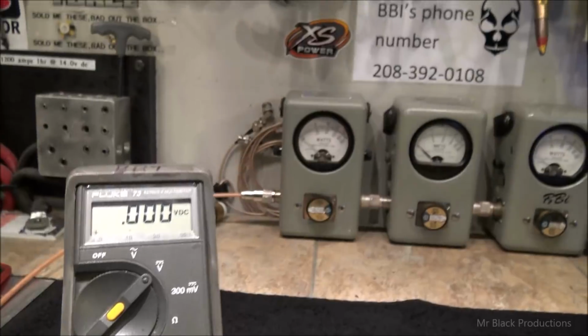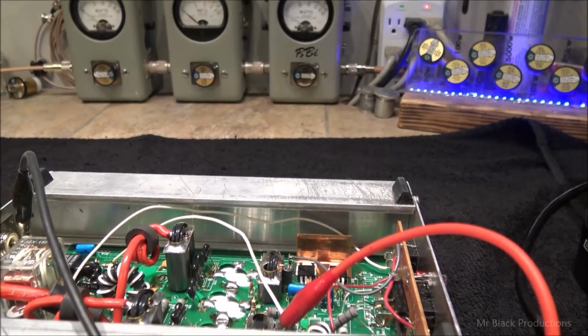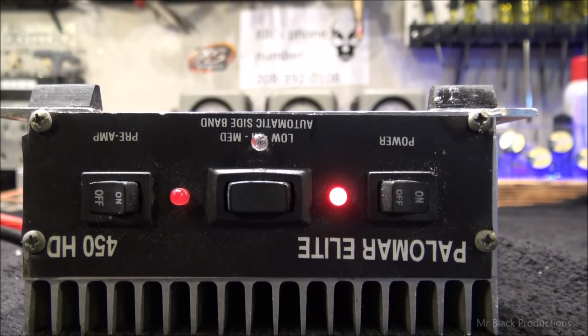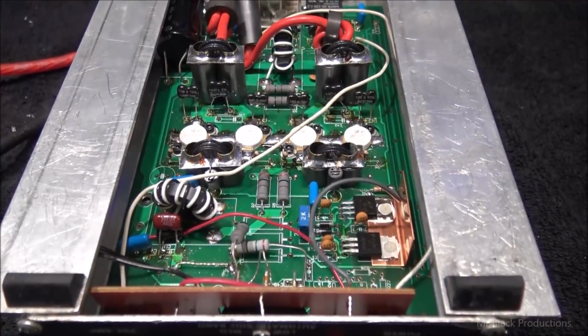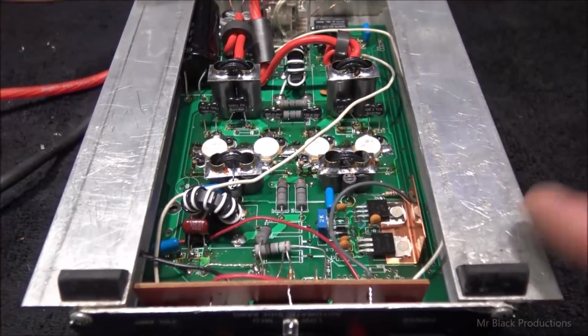Okay. So we are in like Flynn. On that note, let's put some transistors in it. It does a smidge more than 450 watts now. Okay, so turn that off and turn this on. We have gone in and changed a couple little parts. We put four brand new transistors in there, and then we changed the output swamping capacitors across the top of the transformers.